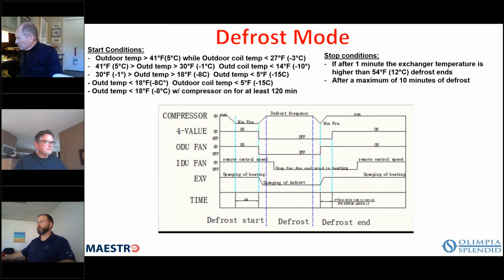And then you just mount the template on the wall over top of where that box is, and you cut your holes out, the 2 8-inch holes and the 3/4-inch one for your drain out of the box. And now you have 3 inches of insulation on the top and the bottom, and left to right, front and back. You have 3 inches of insulation that provide excellent sound attenuation as well as temperature protection and insulation. So it's very easy to do, and it doesn't require that you have to redo the wall. You just leave the outside exterior one in place.